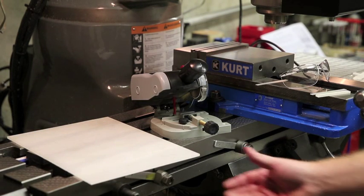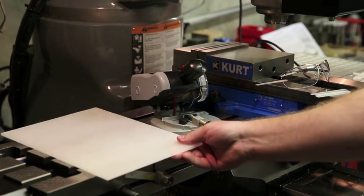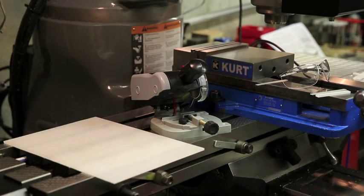So what I'm doing now is I'll just take this piece of plastic and put it right on the vacuum plate. I've written the program and it will machine all five sides for me. I just hit repeat, so I have it repeat as many times down as it can go across the sheet, and then I break them out. We're going to get to that vacuum plate next.